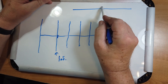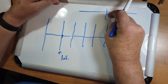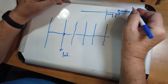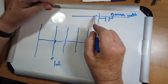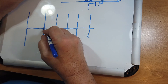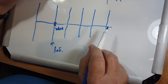One way to make it work is to feed it like this, with there being a capacitor in here — this is called a gamma match. That's one way of doing it, where this right here is connected straight through. If you break it, which you can, right here you can just feed each side. You probably want a balun here, because you want to feed this absolutely beautifully.